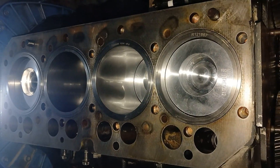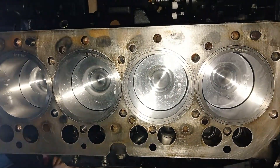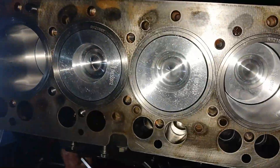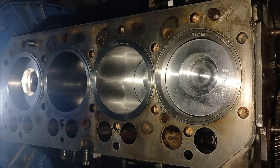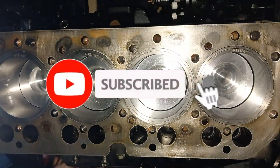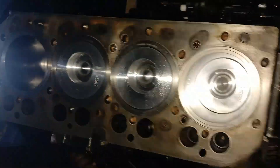After the initial torque and degree torque, check the engine for excessive tightness. Rotate the crankshaft several revolutions to be sure the engine rotates without excessive tightness. Check liners for deep scratches caused by an improperly installed or broken piston ring. Thanks for watching. Subscribe the channel for more videos. If you liked the video, share it with friends who work on John Deere engines.